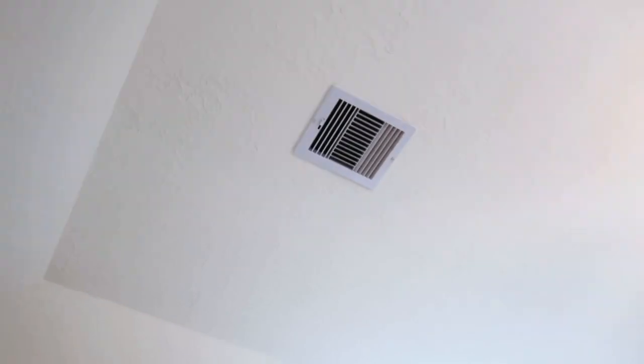The next thing we found on the inside: this vent was blowing out stronger than this vent, and when Brendan got into the attic he noticed it was crimped. There's poor airflow out of this vent — they just need to readjust the duct to get better airflow.